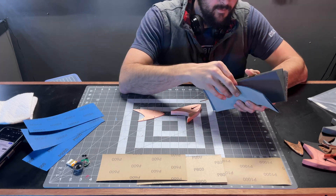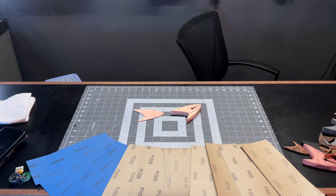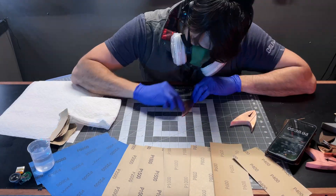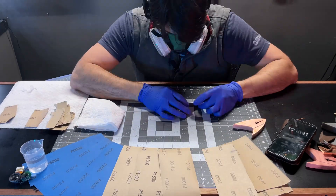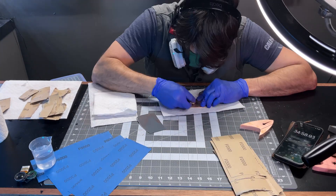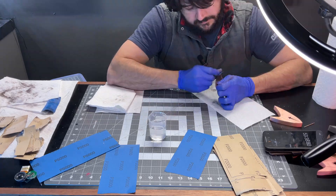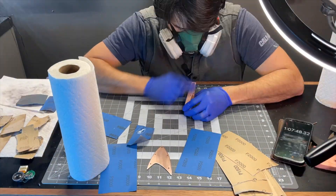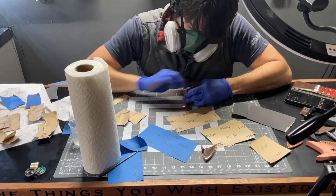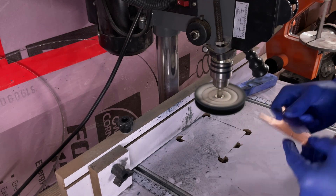Finally, after all that, I finally had a successfully 3D printed piece and was now ready to start polishing the final electroplated layer. I'm going to time-lapse this part because it takes me over four hours to fully sand and polish this piece. I use a combination all the way from 220 grit sandpaper up to 5000 grit wet sanding to get the mirror finish, and then I finished it off using my buffing wheel with a buffing compound to achieve the final finish.